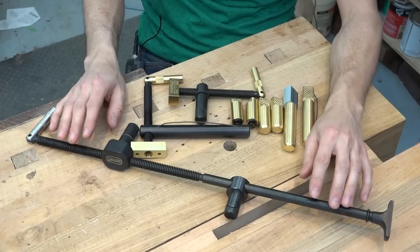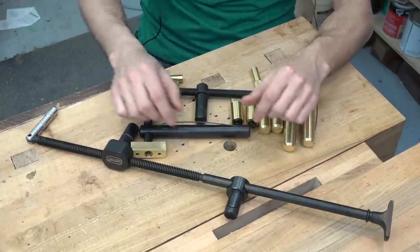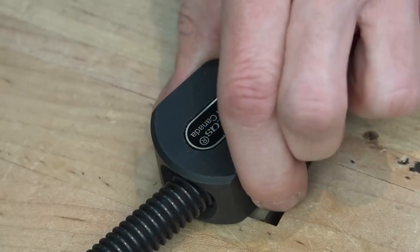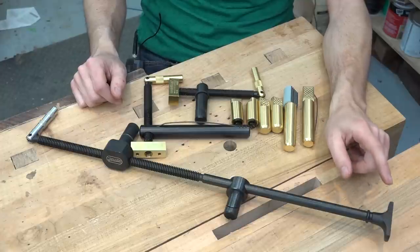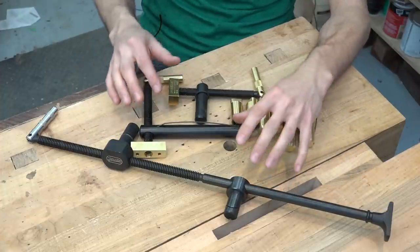The Surface Vise is a more robust version of the Wonder Dog. It has two dog hole posts. The first one here is locking and the other one is a quick adjust screw mechanism. On the end, the face pad that actually pushes against the workpiece can be outfitted with your own custom jaws to make this thing a really versatile tool.